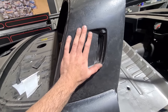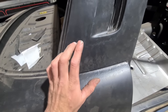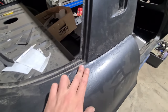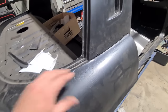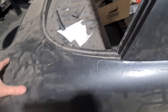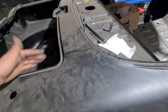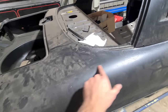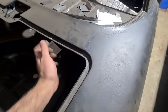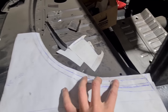I've made this section of the B pillar and I've removed this actual join here between the quarter and the pillar — it's just going to be prone to rust out — so I just put a bead roll on there so it looks like there's a join, and it gets covered by a chrome trim anyway. I'm going to make this section here to about here for the new quarter that I've made, then join it onto the quarter. That way I can get access when I put the quarter on — you can planish that join up easily.